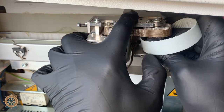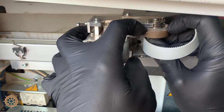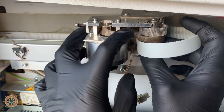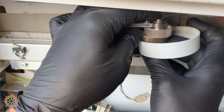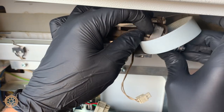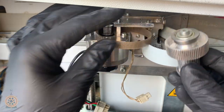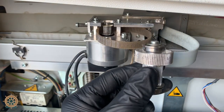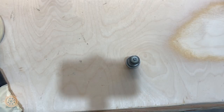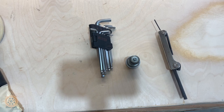Then you'll try to pop that pulley out. Sometimes it's helpful if you slide the band down the x-axis belt — it sometimes takes a little work, but it should slide out. There you go — that is out. Now move over to the table. We need to get the bearings off of the top and the bottom.